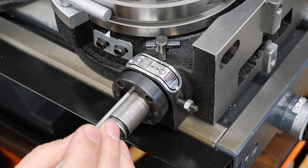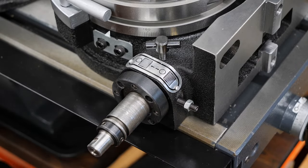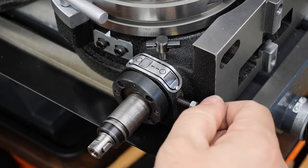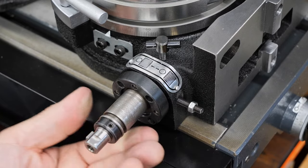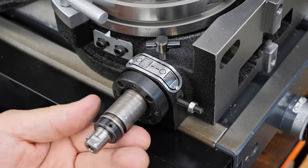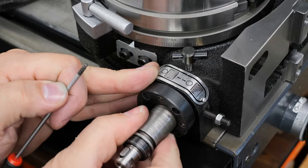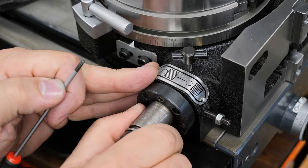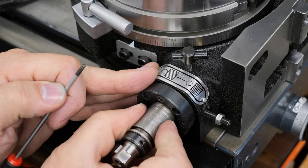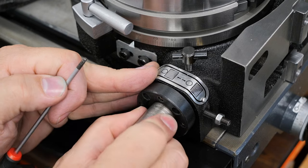You can then bring these set screws in so that they start to lift this whole thing, and then go back and forth from there. So I'm just going to pull that one out to make sure it's not affecting this. In that position, the worm is engaging with the table. In that position, it's not. Actually, I should do it while it's nearly in this position, not where the worm gear is fully engaged, but just disengaged about there, because that's the position that it's going to be in when it operates.